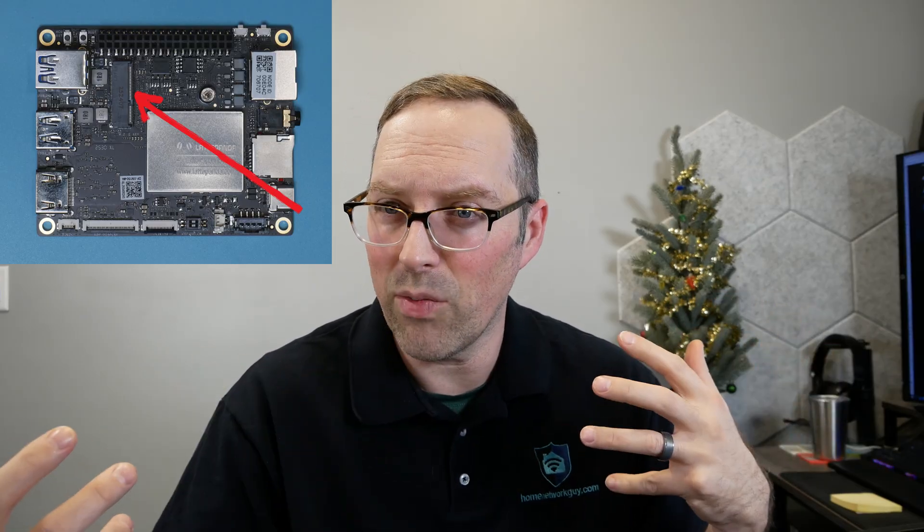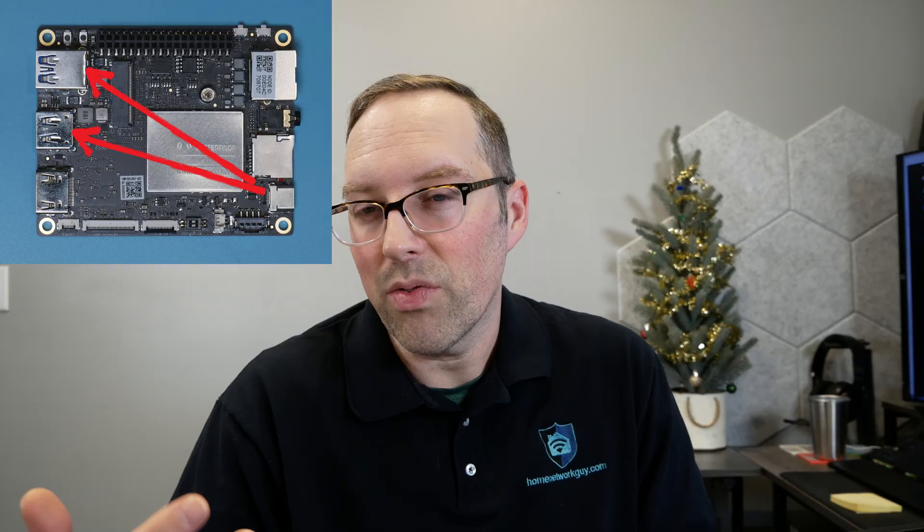There's a lot of accessories already available for it. After covering the IOTA board itself, I'll go over those. As a quick rundown: it comes with the Intel N150, and you can get 8 or 16 GB of RAM, 64 or 128 GB of eMMC storage. It has a TF card slot for micro SD cards, a PCIe 3.0 x1 FPC connector for accessories, and an M.2 E key for Wi-Fi cards — so you can add Wi-Fi capabilities and even upgrade to Wi-Fi 7 components. You also get three USB 3.2 10 GB ports.